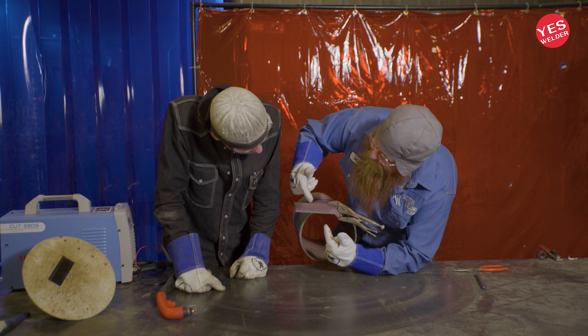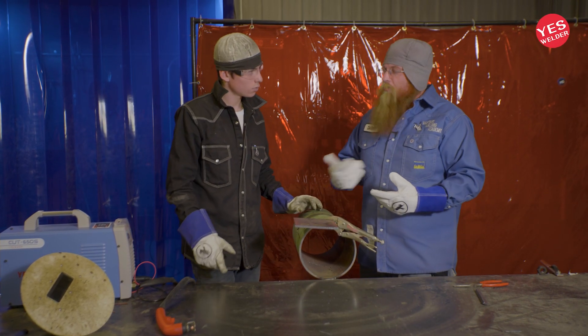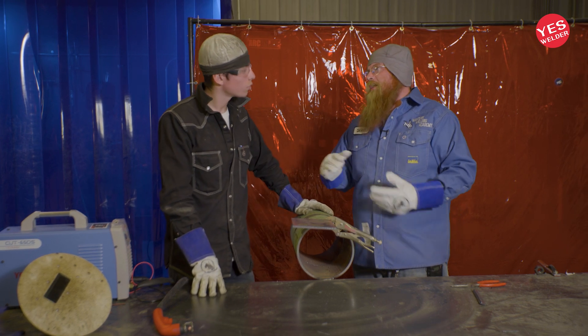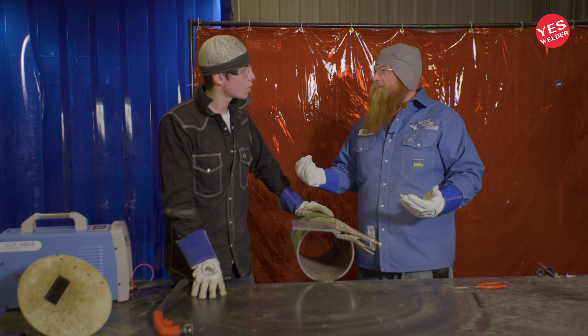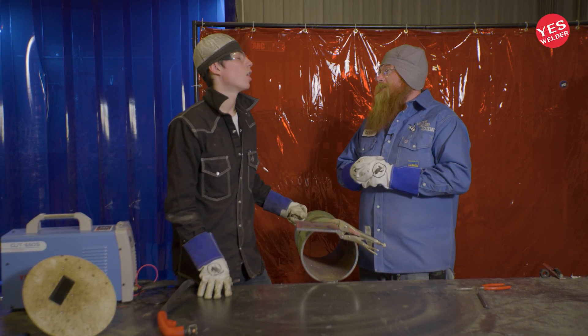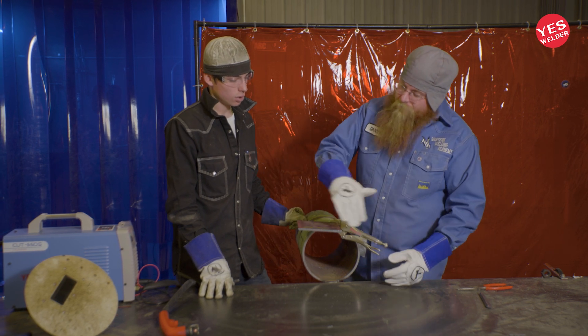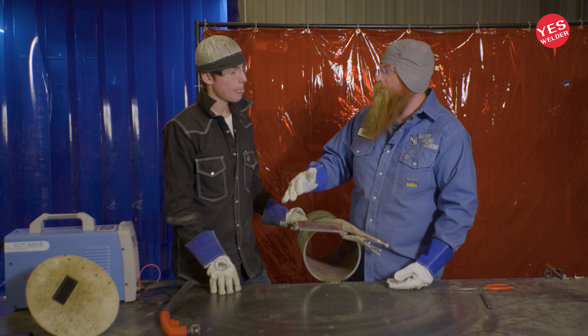One other thing about plasma cutting out on the job — when you're plasma cutting and then welding over it, make sure you grind that plasma cut off first. I don't know what it is with plasma, but it leaves a little film or mill scale on there, and it'll cause porosity. You want to knock all that slag off and grind it completely clean, or at least wire wheel it. I always grind it clean.